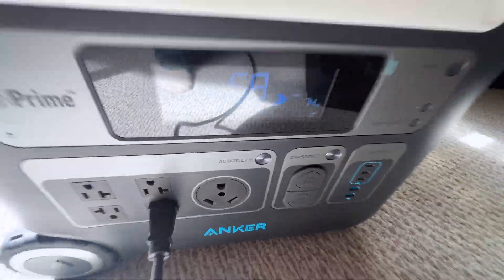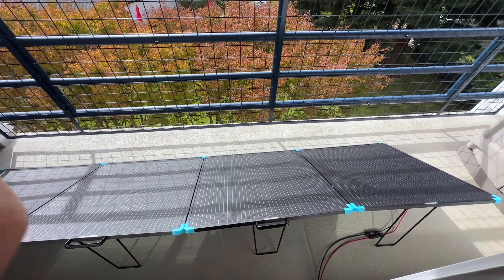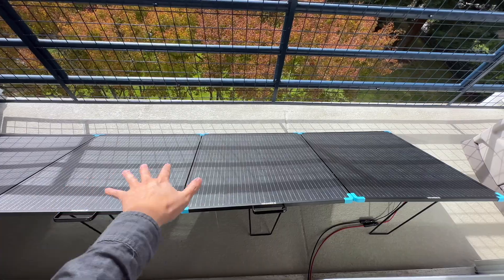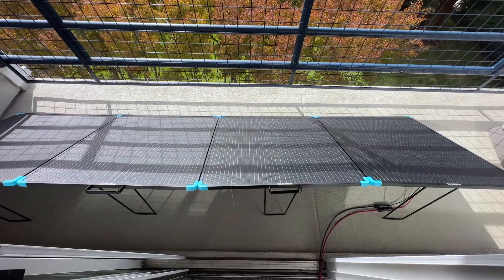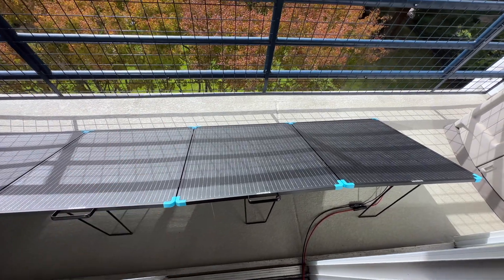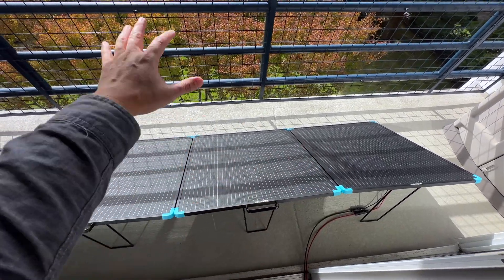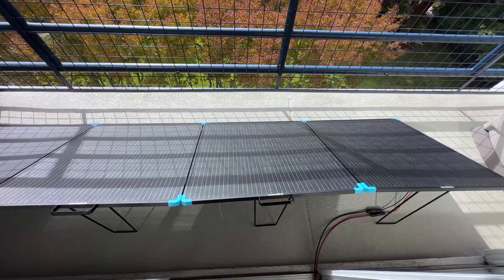This is my power station — as you can see right now it's getting about 75 watts, and I expect that to improve a little bit today. In ideal summer conditions, at the right part of the day, I'm expecting over 100 watts, maybe even 150 or up to 200, given that it is a 400-watt panel. But the main thing is, if you have the space, getting bigger panels is always going to be better because you have more surface area, especially in a sun-hampered place like this with the railing.